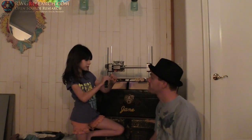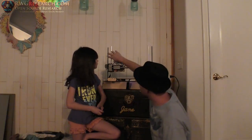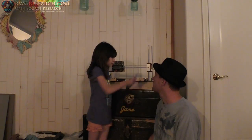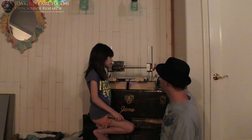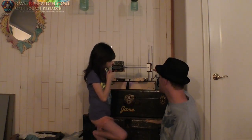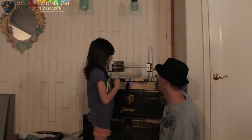Usually it kind of goes up a little bit when it's bent. These look a little rusty too and that might have been catching. So we might need to take a wire brush and brush them - they're filthy. Put a little oil on them maybe. We want it to slip because this is the part that slides - it moves it up or down. We want to make sure this moves freely. The best way to do that is put a little grease on here. This part moves fast so you probably want oil. This part moves pretty slow so you probably want grease.